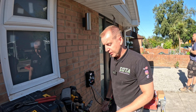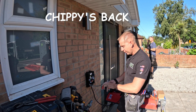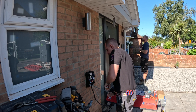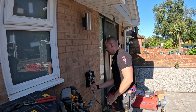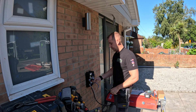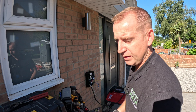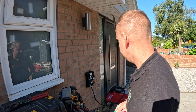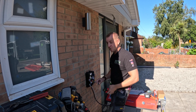I'm going to strip back my twin earth and my Cat5, then I'm at a point ready for dead testing, live testing, and getting it fired up. Inside the consumer unit I've got this protected on a double-pole Type A RCBO. With the twin earth you have the blue and the brown — line and neutral — standard cables, so I'll ferrule those up. The earthing conductor is solid core so we won't be putting a ferrule on that. I need to calm down a bit — I feel like I'm under pressure because I've got a long drive and I really hate driving.